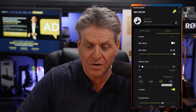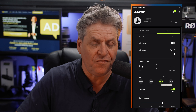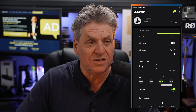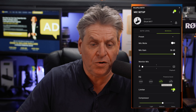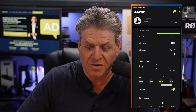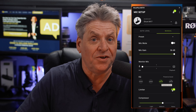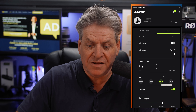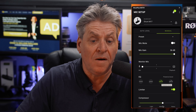And by the way, you can actually have limiter on or off. That doesn't affect the volume. All limiter does is means that if you start to shout, it would stop the audio from over-modulating — it would stop it from distorting. So probably a good idea to have it turned on just as a matter of good housekeeping. And then down here under compressor, you want to set it to medium.